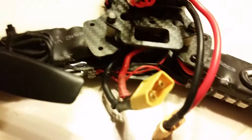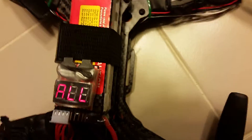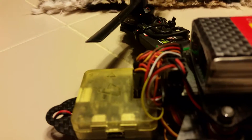As you push the button, I'll show you here. Plug it in — loud beep. Once you plug it in, there's a little button right here. I take mine all the way up to 3.5, and that gives me a really short time. After I got the new CC3D, I took one of the standoffs off, so now it's just a single pillar there with very little space between the battery deck — just enough space for my receiver to get under there, with the wires sticking out on this end.